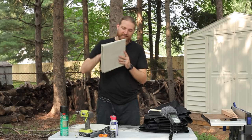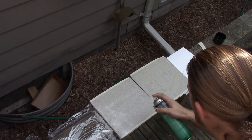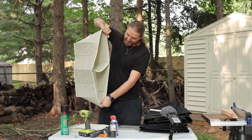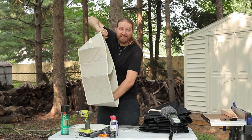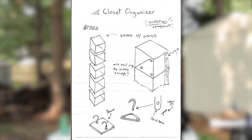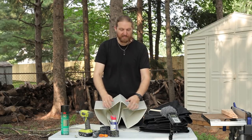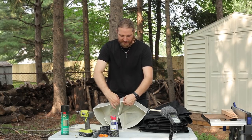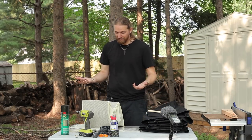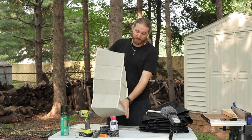Now, I've already done a proof of concept, and I'd say that looks pretty promising. All I did to attach it was just spray the two sides with some 3M90. That's a pretty good bond. You're not going to be putting anything that heavy in here anyway, so I don't see the need to do much more than just that. When I first started thinking about it, I thought maybe doing grommets in the four corners, but I felt like those might rip out. And it is peeling on the edges just a bit where there wasn't some adhesive. You could put a strap across and attach it here, or if you had a really good sewing machine, you could just sew that — very similar to the way they've done it on the store-bought version.